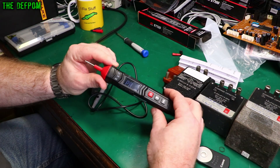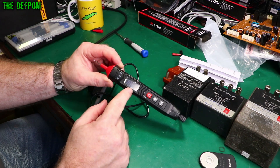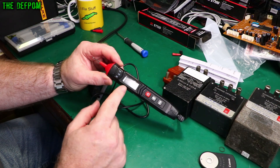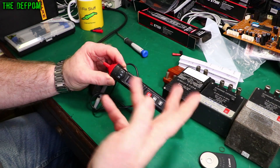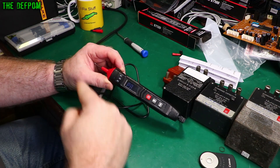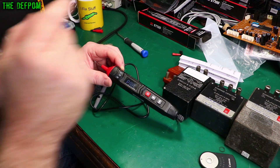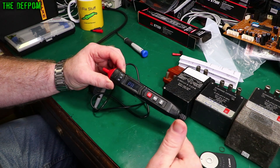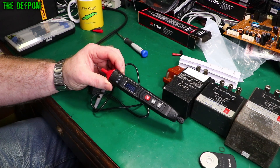PA is phase detection. I think it synchronises with the phase of the frequency — on a three-phase system the three phases are 120 degrees out of sync with each other. This synchronises one phase and then you touch the next phase to detect whether it's 120 or 240 degrees out of phase, telling you whether your phase rotation is correct. Pretty clever.